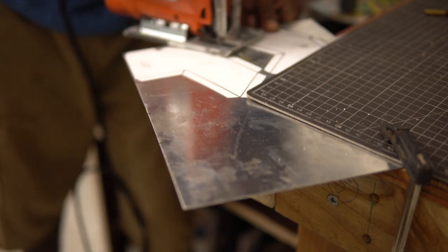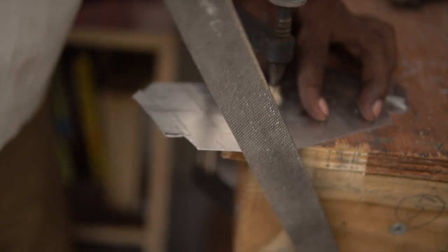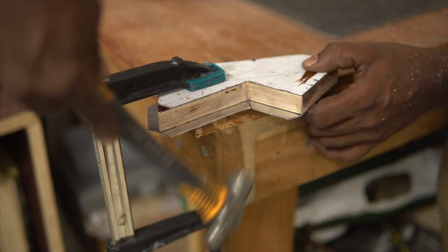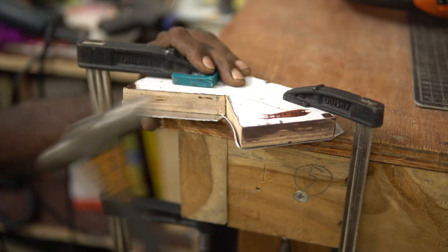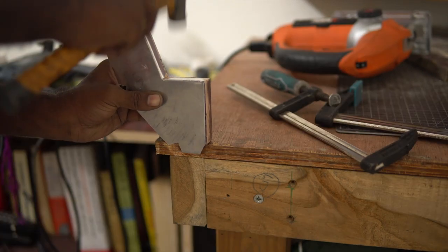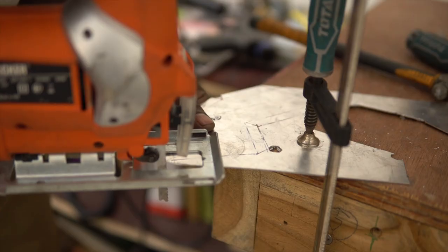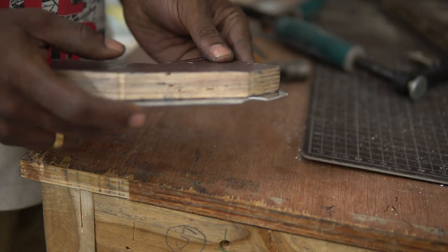Next, I cut the shape on the aluminum sheet. This cutout can now be placed under the die and clamped to the table. The extended flaps can be bent at a 90-degree angle by gently tapping with a small hammer. It is malleable and easy to bend even using a set of pliers. This method ensures the bend is uniform and neat. One side is finished — we just repeat this process for the other side as well, making sure the flaps are bent on the opposite side.